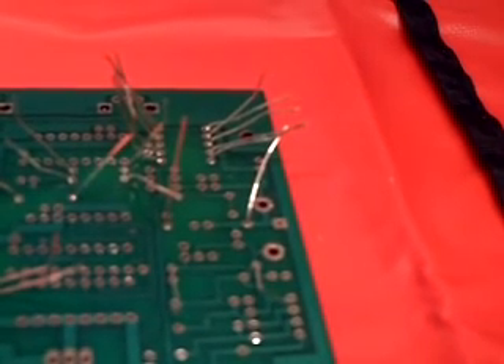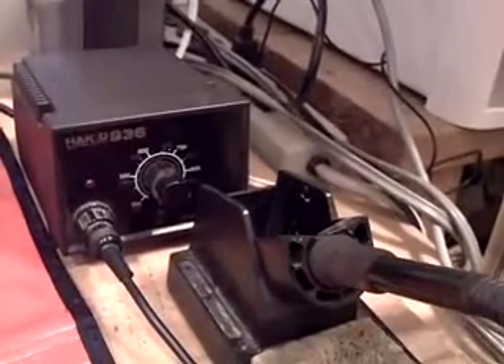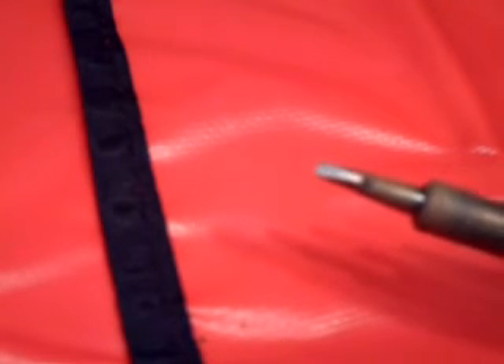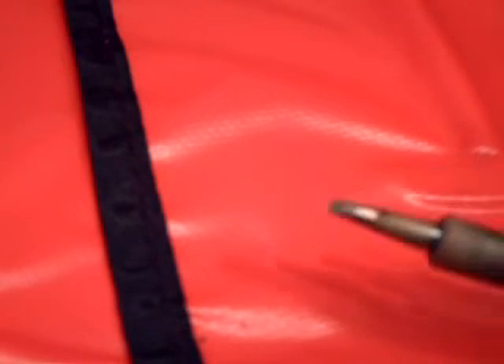This is where the real fun starts. I've got my Hakko 936 soldering station, and I'm going to change the tip. I've got a new tip for it. Here's the old tip — I use this for all the antique radio work, it has a broad flat tip. I'm going to change that by just unscrewing it and taking the tip out. This is a ceramic kind of heater in there.